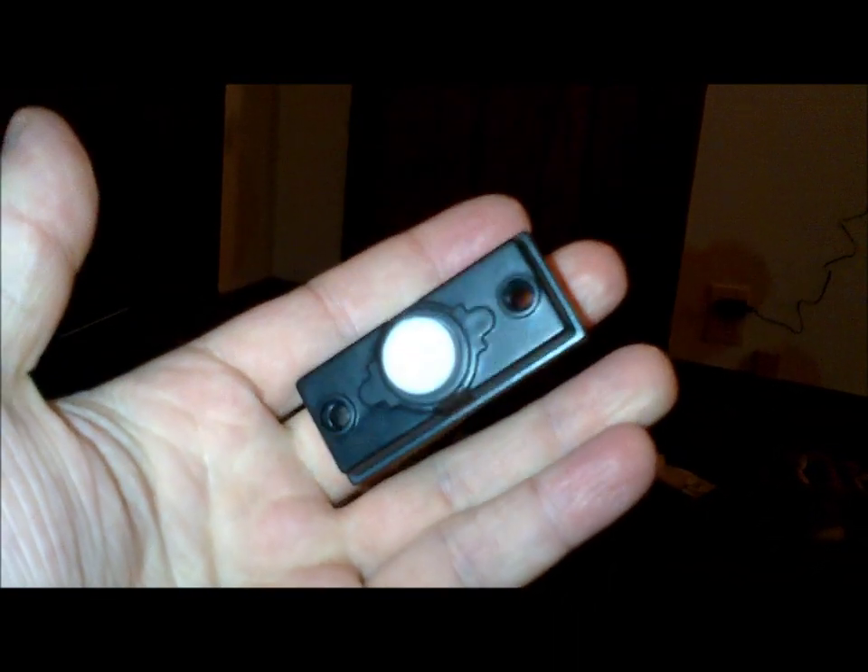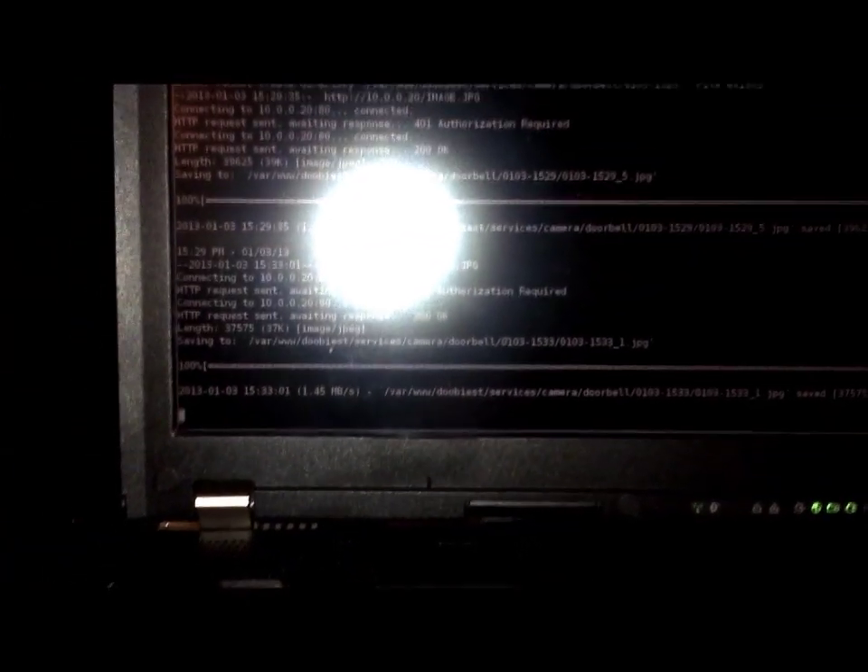So that's all you need: a camera, the Power Flash interface, and the doorbell chime, which is cheap online. Here's a doorbell button — $5 off the internet — and that's what triggers the Power Flash interface. Here's the logic: I push the button, the door chime rings, and at the same time the script I have running in the background connects to the webcam every five seconds and downloads an image, then saves it onto my server. I have Apache running there, and the script fires off an email with a link to that web address.